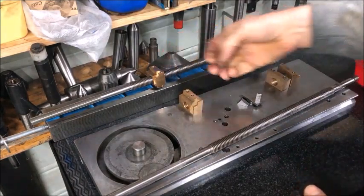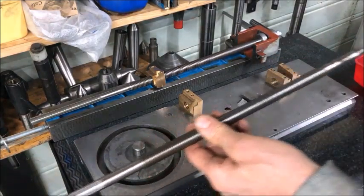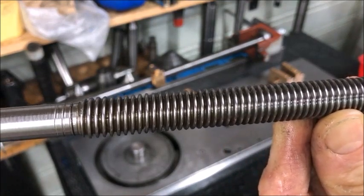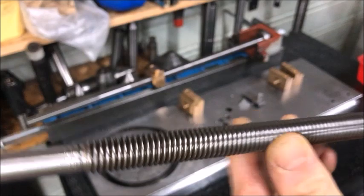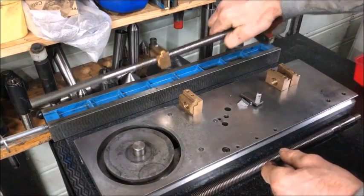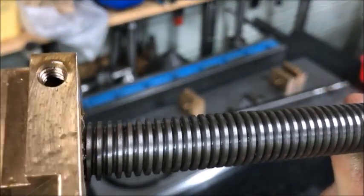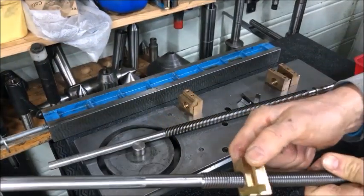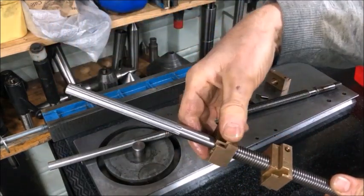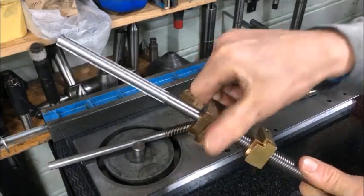My attention is now turned towards the replacement of the screw and nut. The original screw was of a rounded threaded form — not really trapezoidal or acme form, but a little bit — I think to improve accuracy. Anyway, it was worn. The new replacement parts, sourced directly from Colchester, are a regular acme or trapezoidal form screw. And you can see the nut: one of the new nuts fits tightly, while the old nut, even worn, won't enter — so it's a different form.